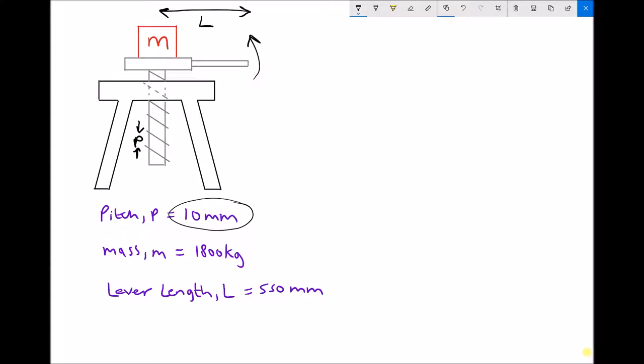The advantage of moving through a large distance to achieve a very small lifting distance is that the force requirement is going to be a lot lower. In the last video we talked about how the work done when applying the force is equal to the work done for lifting the load, providing there are no losses in the system. Work done is force times distance, so on this lever we apply a force F subscript a (the applied force) and move it through a distance d subscript a — the distance traveled by the applied force, or one full revolution in this case.